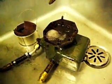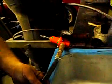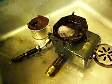And there's your Packard problem — oil cooler's leaking, only at two pounds. Two pounds. So if you set your own air test rig up, you can pressure test stuff like this and save a lot of headache.